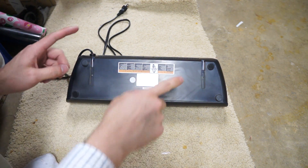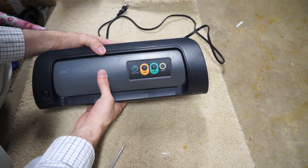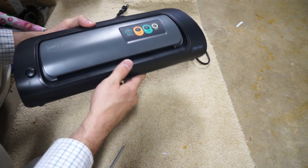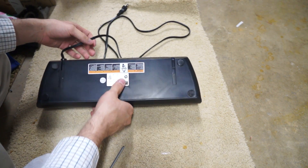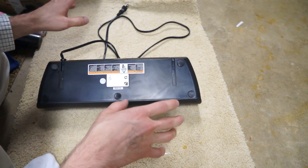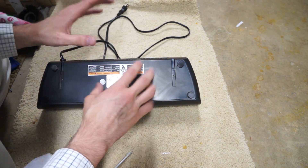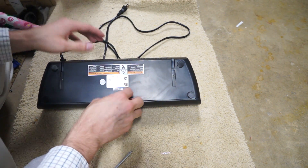I'm going to walk you through how to switch the gears around in this GBC H220 heat seal laminator. This thing is awesome for making circuit boards, but when you first buy them they go real quick and that's not what you want — you want to slow it down. So as per the suggestion of the guys over at Pulsar, we go and we switch these gears around, and here's how.